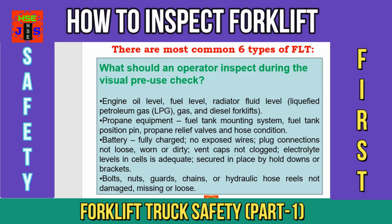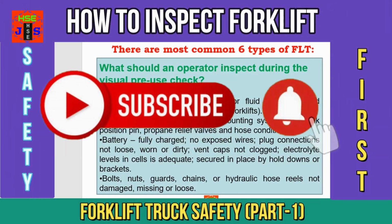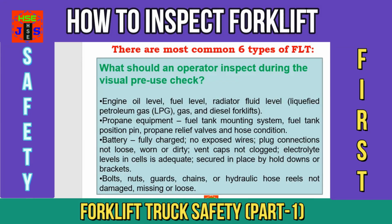Inspection of a forklift truck is in progress and an operator is conducting visual pre-use checks. Point number six, engine oil level, fuel level, and radiator fluid level. Point number seven, propane equipment, fuel tank mounting system, fuel tank position pin, propane relief valves and hose condition. Point number eight, battery fully charged, no exposed wires, plug connections not loose, worn or dirty, vent caps not clogged, electrolyte level in cells is adequate, secured in place by hold downs or brackets.